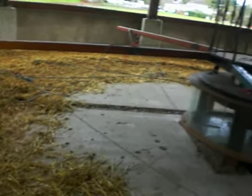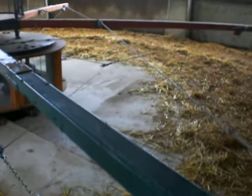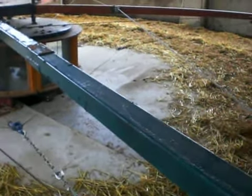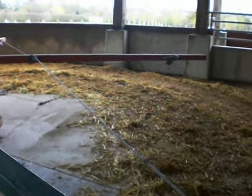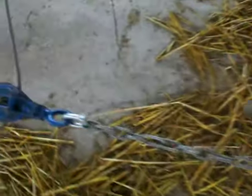And this cable is a circle that goes all the way around the mill. So on each arm, there's a similar system of a cable with pulley wheels that distributes the load through the whole system. So by pulling on this cable, the load is distributed to all the 5 arms. So again, there's a pulley wheel here. I go down this cable that we've just been pulling, swap over the next cable, and then we have another pulley wheel at the end. And that just simply is basically to run on this cable here. And by pulling on it, it pulls the cable, and that distributes the load to all the 5 arms.